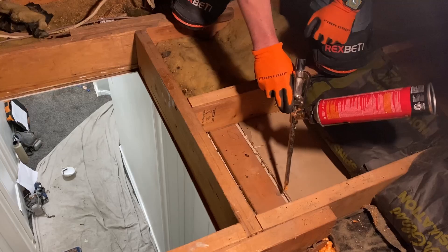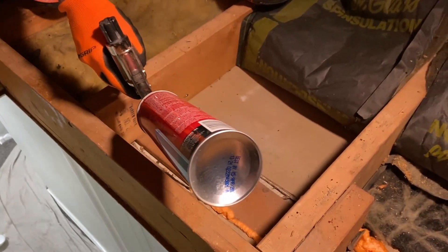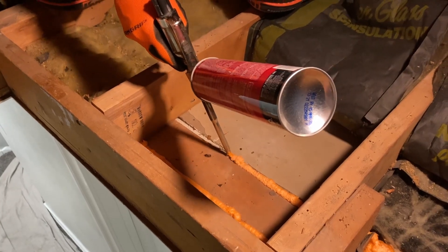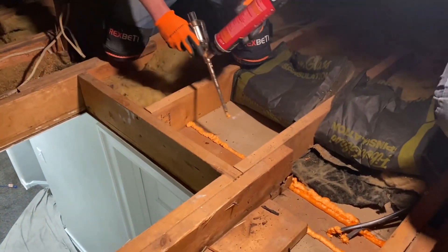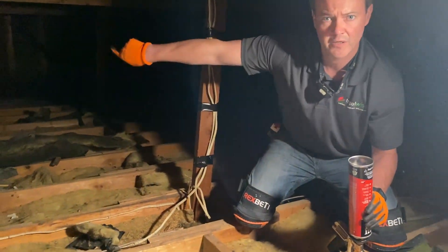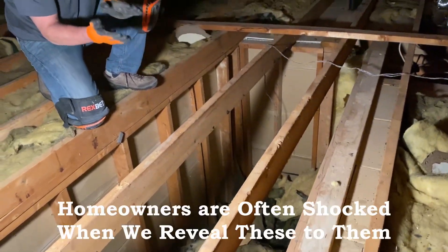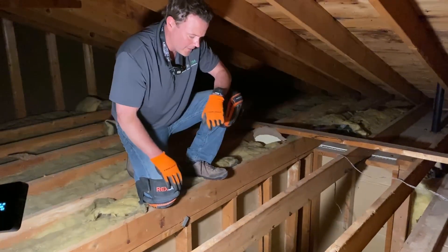As we go along, I come to this bay — you can see another top plate and you can see how big these gaps are. You wouldn't imagine that air would be able to rush up these things to the extent that it can, but anywhere you've got an outlet or anything that allows warm conditioned air to get into these stud bays, it then allows air to come up and escape through these plates. So we're going to go through this attic and seal the top of every interior wall and also seal the exterior walls as well. The next thing we're looking at is a stairwell void — a classic one that I pointed out from below.